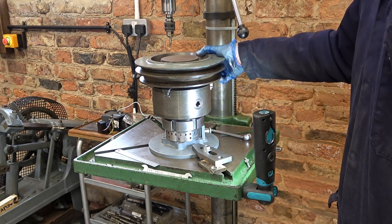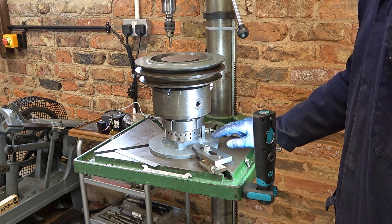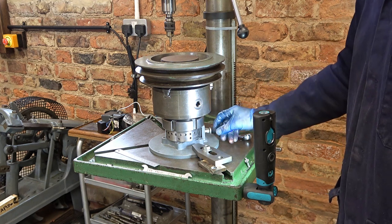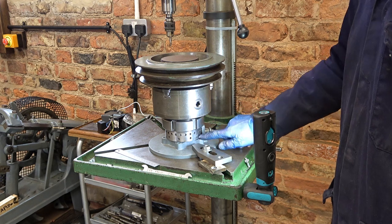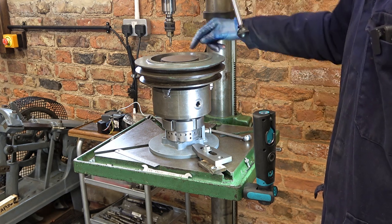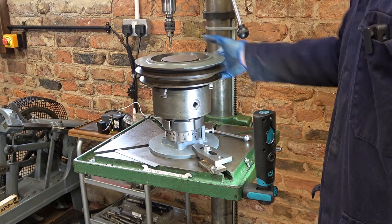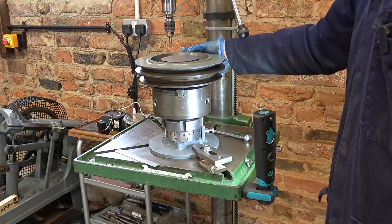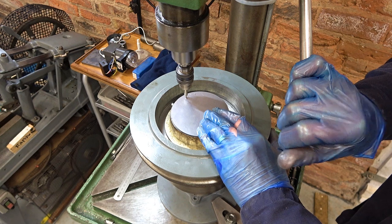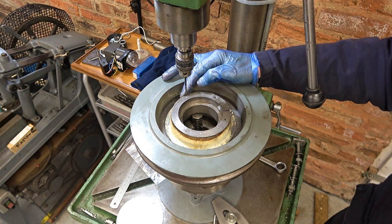It has one weakness: a little bit of movement because I've got a spring-loaded pin and didn't make an inbuilt clamp. I should have done, but I'll get round that one day — I'll replace the spring-loaded pin with a screw so the peg locks it solidly. For drilling five holes you locate one, then rotate two holes at a time to give fifths and spot all the way around. It's as simple as that.